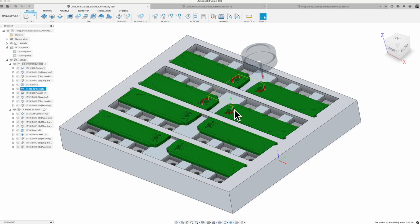And then we're going to cut the pockets. We're going to cut around that crescent. I had an interesting issue, the computer was doing something weird. That's why I did those as two different operations. And then I'm also going to get in there and ream out that pivot pin hole, then drill and ream the last hole on the blade.